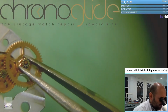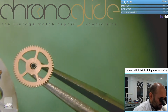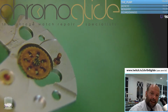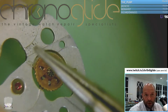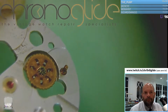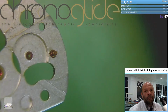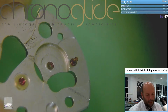I like to do the inspection straight away. Oh wow, there's no lubrication whatsoever in here. It was really stuck. I know quite a few watchmakers rinse the complete movement first and then do disassembly, but I'm a firm believer, I'd like to see all the debris and where it's coming from, so I know what happened in the movement. And that's why I'm not that much of a fan of rinsing first, because I would like to see during disassembly what happened with the movement.